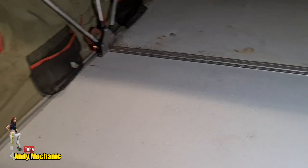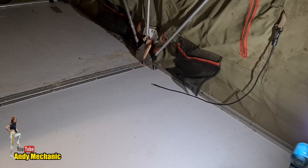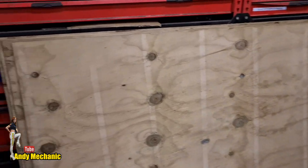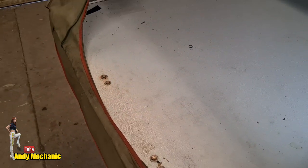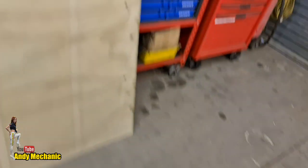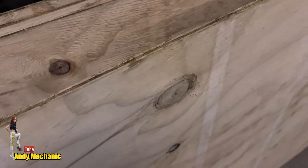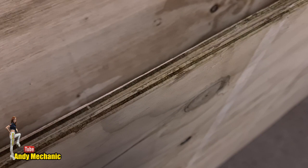It is Christmas time, and there's very limited supply of stuff. So all I managed to get hold of was some plywood, and I couldn't even get the right thickness. The thickness of this board, including the two pieces of aluminium, is 21.88 millimeters, and that's critical, because it's got to fit into this groove that actually goes over the outside. It's a bit of channel. Maybe you can see that in there. Look, actually fits inside. So all I could get was 9 mil ply. So two nines sandwiched together gives us 18 millimeters.